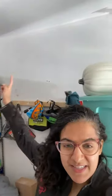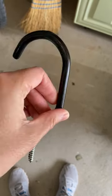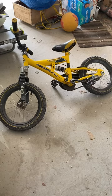All right, now that I got the space cleared out, we are gonna hang up Mikhail's bike. So these are the hooks that I used. I got them from Amazon. You want to make sure they go into a stud. They come with anchors. Do not use an anchor. They need to go into a stud. I'll link these below in the description box because they're such an affordable way to hang your bike.